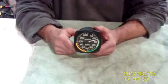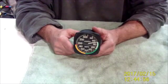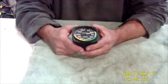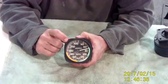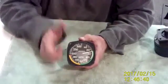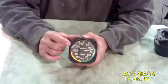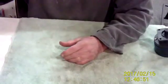The reason is the airspeed indicator was thought to be clogged, so someone went out to the pitot tube with compressed air and hit it with compressed air — not a good idea. It blew the bug further into the line. You need to take it loose from the back of the instrument and blow out the other way — take it loose at the wing root to blow it out. This damaged the instrument; it's going to have to go to a repair shop to be overhauled. Not a good day — just simple operator error.